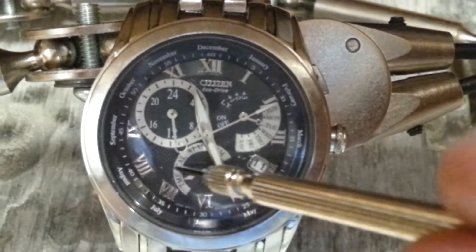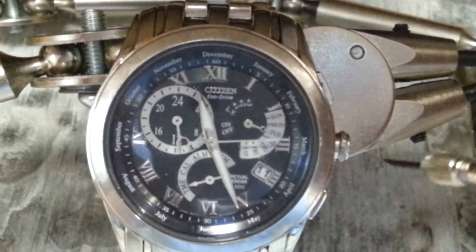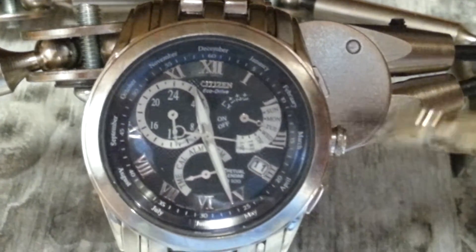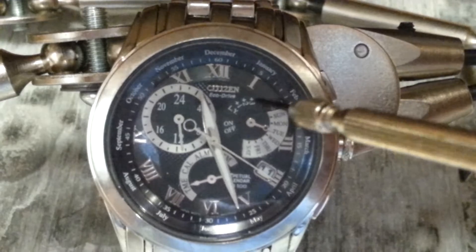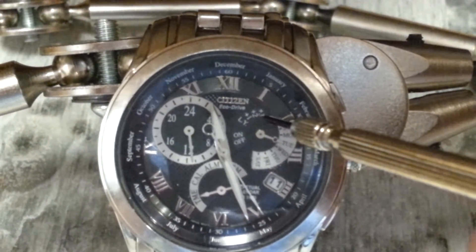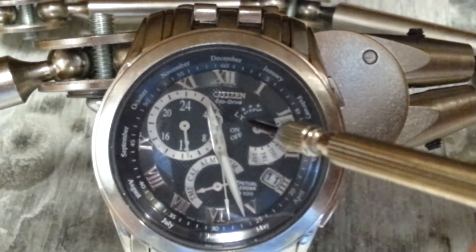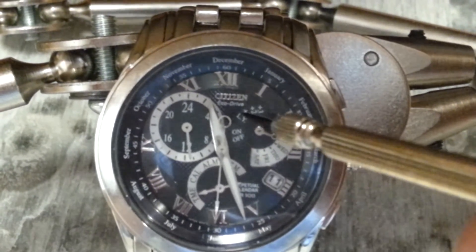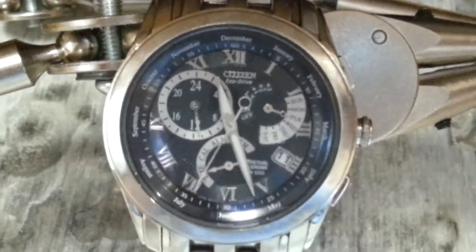Calendar, on the other hand, is not so straightforward. Pull it out one click, put it over into the calendar mode, and then set your calendar accordingly. At that point, your leap year — this being 2015 — my leap year is going to be number three, plus three. I always remember as a watchmaker: the leap year is on the year that I vote.